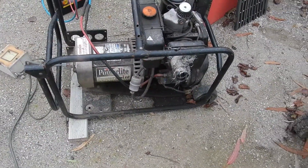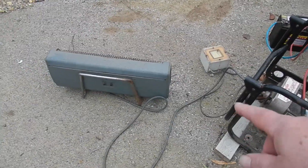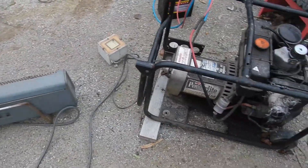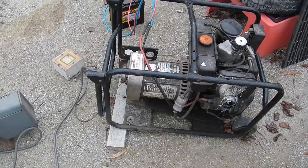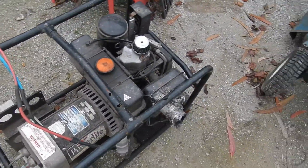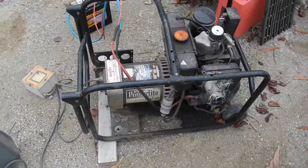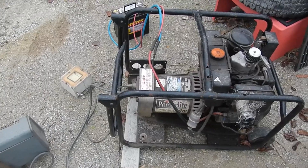The setup is going to give it a bit of a run after the oil change. We've got 2400 watts of load to put on it. It can put out 15 amps. It's a 3.5 kilowatt generator. I'll play with the governor a bit and see if I can get the hertz right, because with no load you're over 53 hertz.